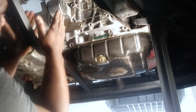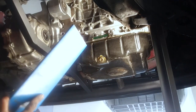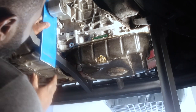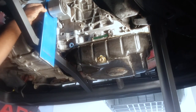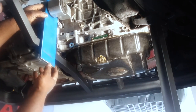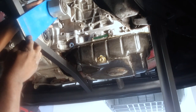Now we're going to start making the angle iron parts to go up here and connect to that bolt. So basically we're going to do something like this — pull it through right here. I would love to put this like this, but there's a problem: it's going to block the CV axle from getting inside the transmission. So I'm going to have to tilt this back this way just to get enough clearance.